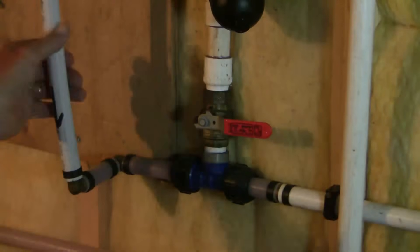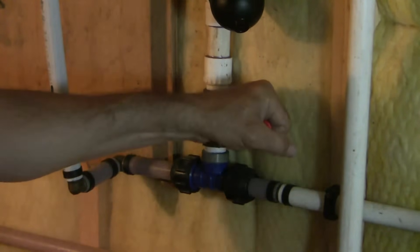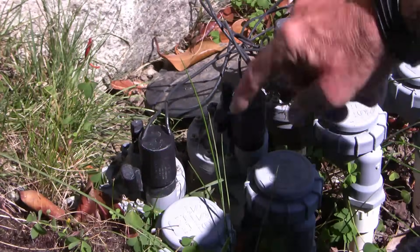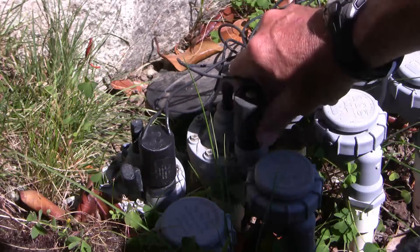In my experience the most humbling and common mistake is the oversight in the first thing in the spring — of course the first thing you need to do is turn the water back on. The first thing you want to do is see if you can open the zone manually. Here's a solenoid, and this is a zone — you'd take this little handle and rotate it counterclockwise and see if water comes.